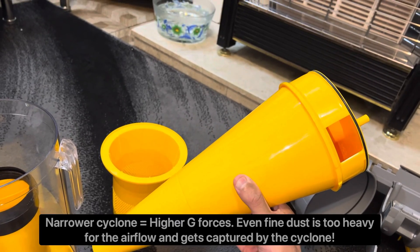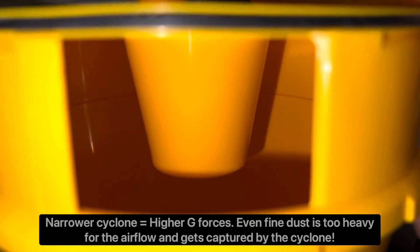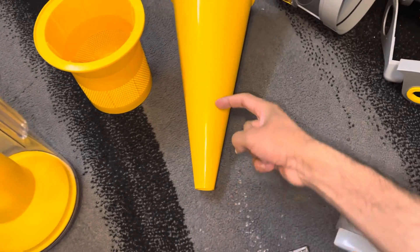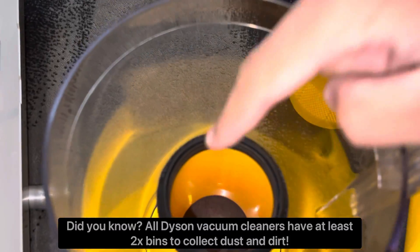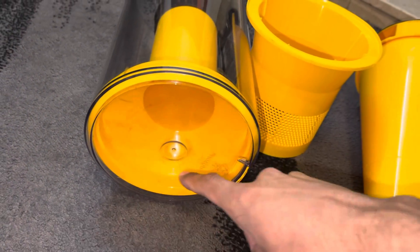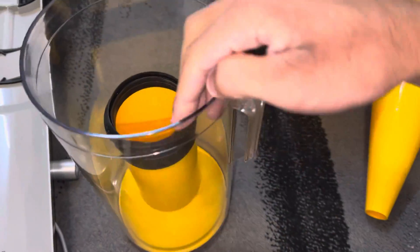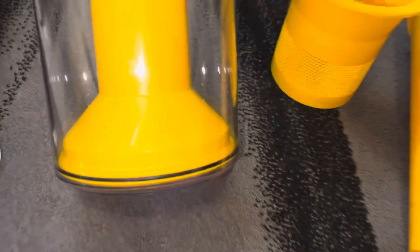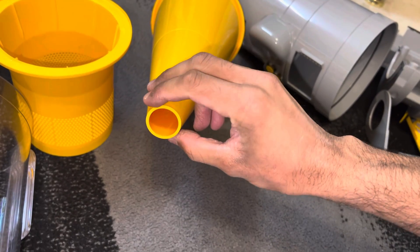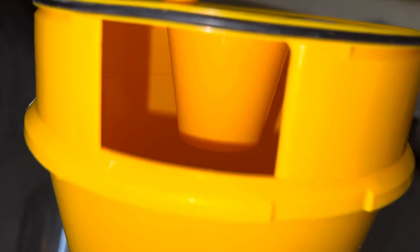The airflow does a whole U-turn and then enters the secondary cyclone, which is where the cyclone turns into a cone shape. It's a cone shape because the airflow multiplies in speed — as the walls get narrower the speed accelerates. You can see inside the cyclone it spins around and around, the dust comes to the bottom and falls into this chute right here, which is a secondary bin. This is what people fail to understand — all the fine dust gets captured in the bottom of the bin here. Because this is sealed with a thick gasket, there's no airflow at the bottom. This part is just an opening chute for dust to fall out of. The air then exits the cyclone through this little chimney right here.